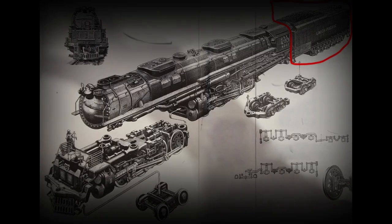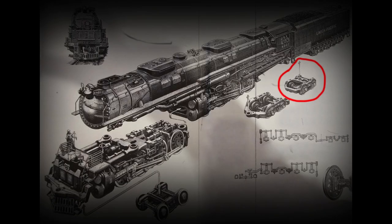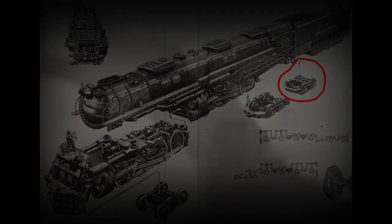Designated a 4-10-0 or centipede type, the 218-ton tender provided non-swiveling mountings for a five-wheel and axle assembly. The advantages of this assembly over using a conventional truck were a reduction in the number of moving parts and less dead weight in relation to coal and water capacity. A four-wheeled guiding truck eased the tender through curves, with its pivotal bearing placed on a crossmember or bolster, which kept it centered above the rails by swinging left or right on rockers.